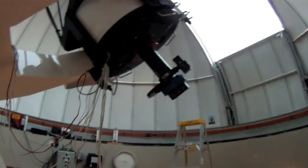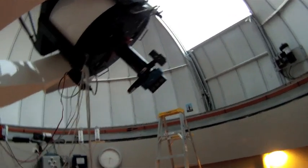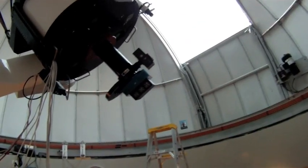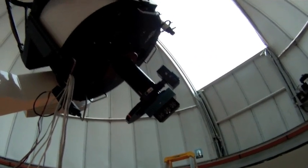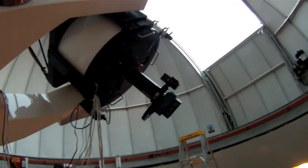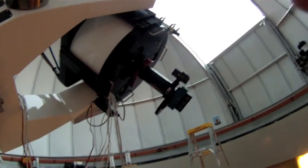They'll refresh the gas in the CCD chamber. If you haven't sent your camera back to Apogee in a while, they're using a new gas. I can't remember, they went from argon to xenon or something like that, but it's supposed to allow the camera to cool more effectively. This one has the D9F cooling on it that allows it to cool to -65 degrees below ambient, so it's not much of an issue with us, but it does have the new gas in the chamber anyway. But take the cameras off, all that out of the way, and now's a good time to clean that. So I won't bore you with taking those off, but I'll go ahead and do that, and I'll get the instruments all situated for cleaning.